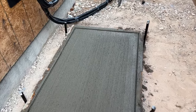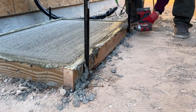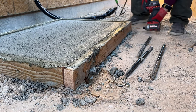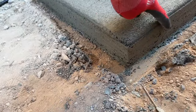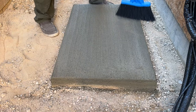I let it sit overnight. Now I'm back the next morning — this has sat for at least 18 hours, almost 24 hours, still pretty cold out here. The forms are ready to come off because I want to start letting this thing cure. You can still scar the concrete right now — rubbing wood on top will start to scuff it — so I don't want to mess with it too much. I unscrew the forms out of the stakes and take apart the forms on the side. Use a hammer or sometimes they'll just fall off. Pull the forms off, let it breathe a little bit. It is firm, but it's not meant to be walked on yet or have anything put on it — let it sit for at least several days, depending on the weather. This thing won't have anything on it for probably a month, so plenty of time to cure. Give it a week, give it 30 days if you can. Check your edges. I hit it with the broom again lightly, but don't put anything too hard on it like a nail or hammer — it will scuff and pull away.